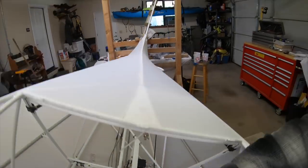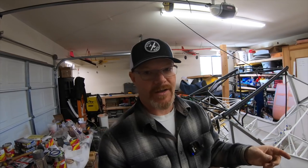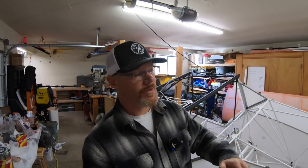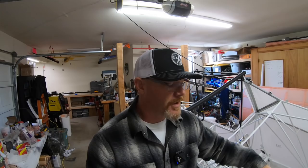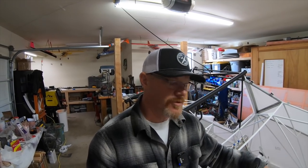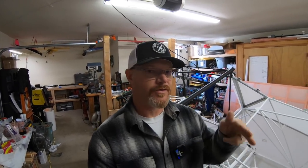Now, the Garmin servos, I noticed that the pitch servo actually comes with a cage that goes over it, and the Kitfox bracket is pre-drilled for that cage to go in there. I have the Grand Rapids servos, and they have a mounting kit that I didn't order because I was ordering the Kitfox kit. So I'm going to talk to them today and see if they have that cage that limits the throw. It goes right to the edge of the full throw of the servo, and then it doesn't allow further movement of the arm. If they have one, I'll definitely get that to go on there. If not, I'll make my own. You could even just put a stud in there that sticks out far enough so that the servo can't go past it.